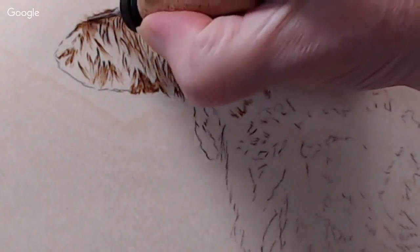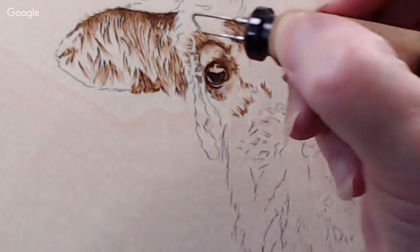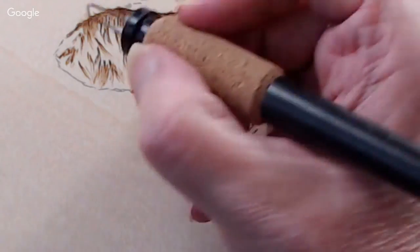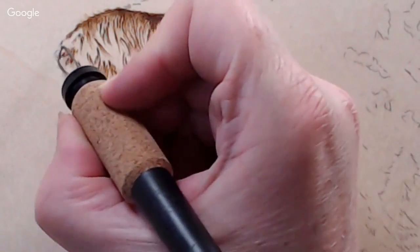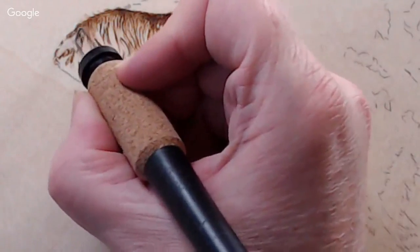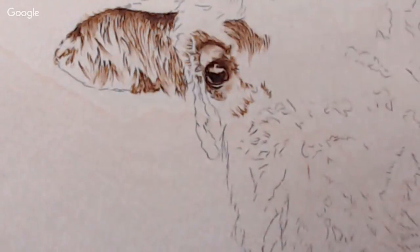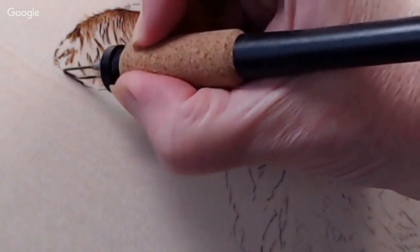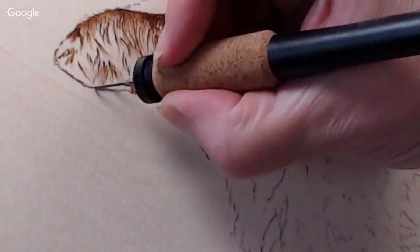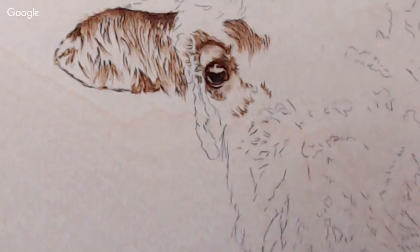I think if I burned a little deeper and hotter, and then only used a couple of coats of spray sealant, they could feel it better. Because when I do the brush on polyurethane, it fills in the grooves a bit more. I mean, they're still there, and you can feel them, but not as obvious. But if I did a spray sealant, then I think so. And I've thought about that too. Maybe I should try. Because as long as the work is sealed, I don't have to worry about anybody's oil from their hands interfering with the wood or anything.